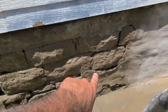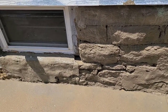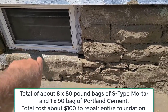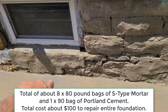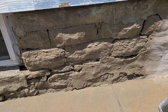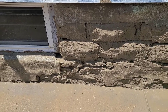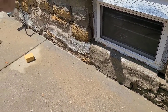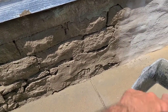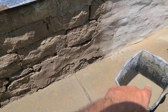I usually mix up enough to do about a three-by-four section - that's probably as much as I'd want to do at a time. If this section starts to dry up before I get back to it, I'll just dampen it again and go over it with a lighter coat. Now I'm going to mix up mortar kind of thick, fill in these cracks, then go from there. If I have extra, I'll go down and fill in some of those bigger cracks. Sometimes if the mortar is thick and I'm ready to smooth out, I'll just add a little water and use what's left.